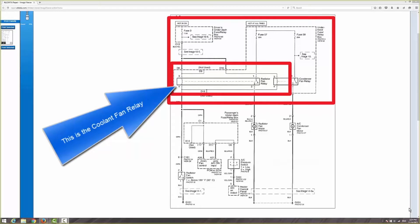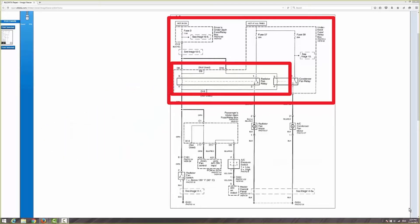We got the fan. We have the fan control side. You see the switch? Remember, the switch goes to the load and we have the control side. The control side goes to the switch. Our objective is to get this side to work so the relay switch will engage.